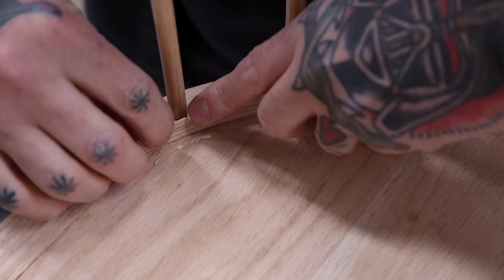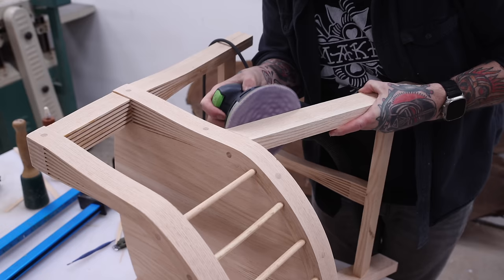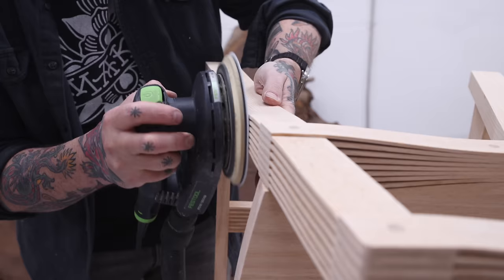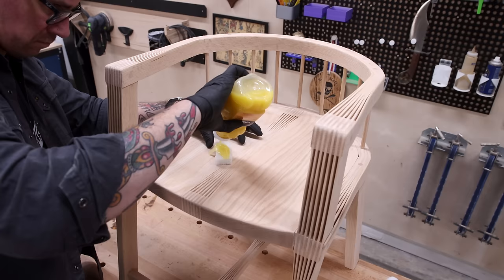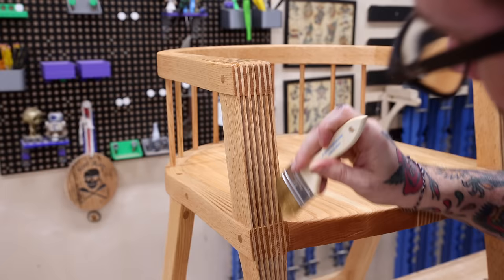The seat pan fitment was a little gappy, so using this thin scrap I'll hide that gap — there's plenty of glue surface for a strong enough joint. I also added dowel pegs to further strengthen the glue joints and finger joints between the front legs and the curves. All that's left is a good sanding. I made a little popsicle-stick sanding block to get in between the slats where I had some glue squeeze-out. After sanding the whole chair to 180 grit, I sprayed it down with water to pop the grain before the final sanding. To finish the chair I'm using Total Boat Wood Honey — one of my favorite and easiest finishes. You just wipe it on, buff it off, and it looks awesome. For between the slats, I just use a chip brush. And with that, this chair is finished.